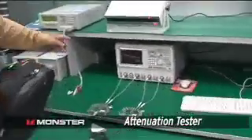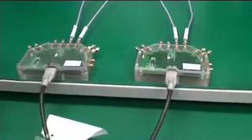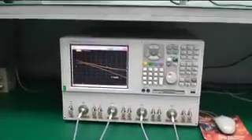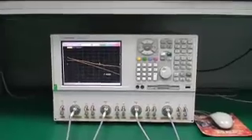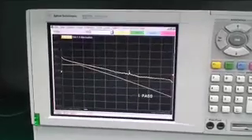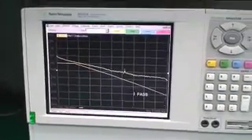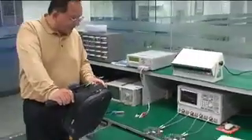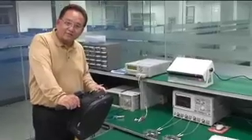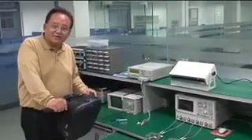This machine also measures the attenuation between the conductors. You can see the HDMI cables measured — input versus output. The diagonal line is the reference: that is the 1.3 category 2 line that you should not go below. Above is the actual performance, and you can see we're well above the required minimum, showing that Monster has less attenuation than other HDMI cables.